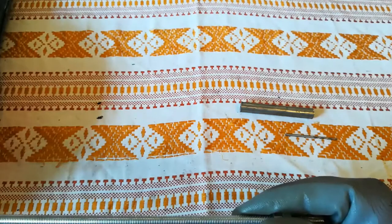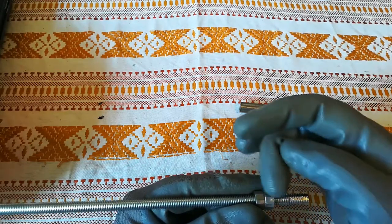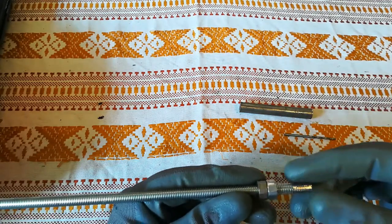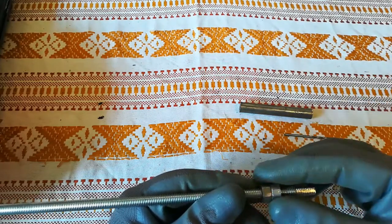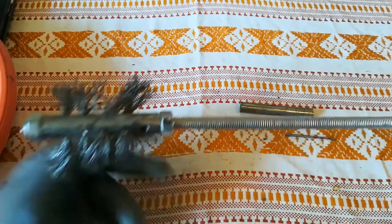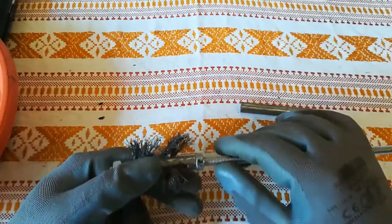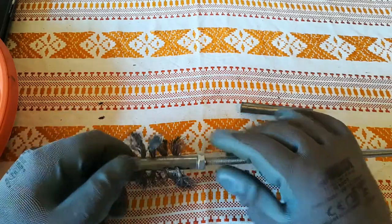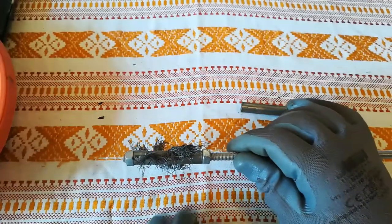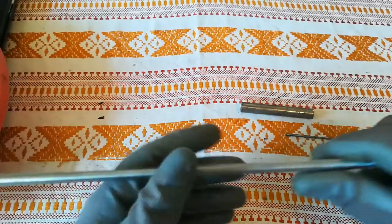Here on this end, how I made this triangle is simple. You tighten two nuts like I did and then just mark this area with it, skip one of these surfaces, do it on the next one and you will end up with a triangle — six divided by two equals three. It's a very simple design, simple device. It works flawlessly. You could also cut this shorter and use it in a drill for outside cleaning of surfaces. Maybe put two bearings here and make some device that you can just slide your pipe or whatever you are cleaning through — that would also work. So that would be it for today's video. Thanks for watching.